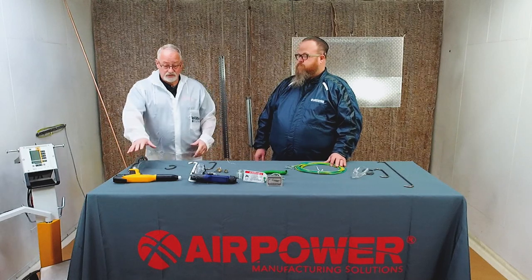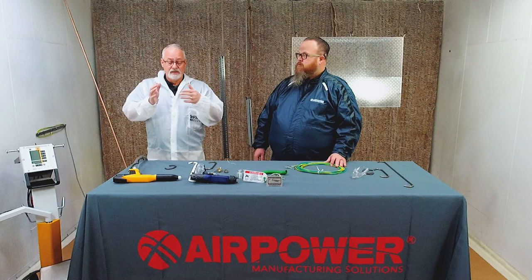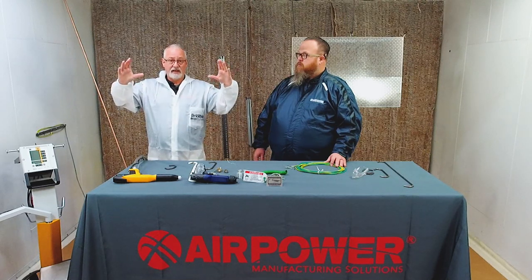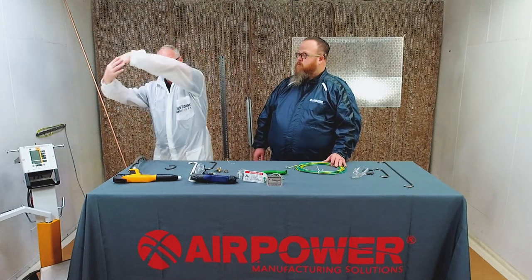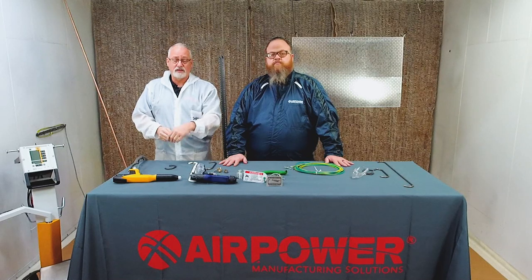One thing to think about with that for the back ionization, what Travis was talking about, tip to ground distance. If you think about your electrostatic field that's out in front of that gun, it's big, right? So you're taking all of that voltage, all that energy, and pinpointing it, and it's just too much. So try not to get too close. So target distance is very relative for a good finish and optimizing your efficiency.